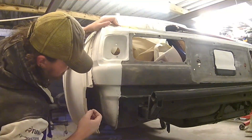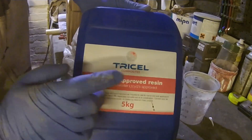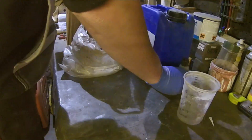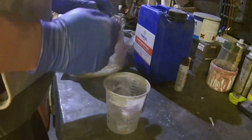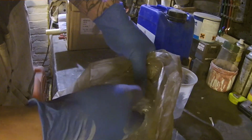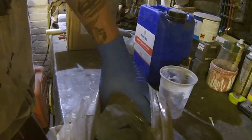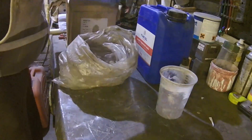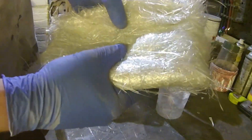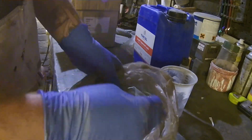It's now time for the joyous event — fiberglass. So what I'm going to be using, resin-wise, is Tri-Cell Composites fiberglass resin. I think it's like 10% of this to hardener. I'm also going to be using chop strand — just individual fibres — because you can jam it in the hole. Normal mat is unfortunately too thick and not flexible enough at the moment. That will be used later as a surface on the face. For now, just to stick the two sides together, it's going to be chop strand.